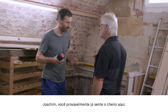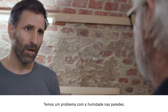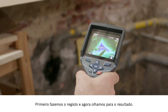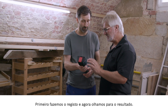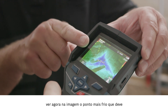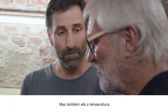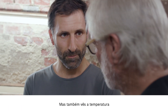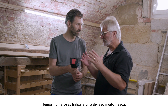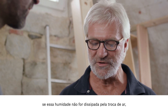You might be getting a whiff of something here. Yes, it smells a bit musty. There's a problem with damp in the walls — you can see it in this corner, for example. So now you know what to do: first we get scanning and then we look at the results. The most important thing is that you can see the coldest point in the image — it's a very clearly different color in the temperature display. You can also see the temperature around this point in the wall, which allows you to make a comparison. We have a lot of pipes and this room is really cool, which causes condensation to form. If we don't get rid of this moisture through ventilation, we will start to see mold form very quickly.